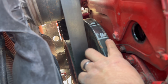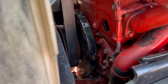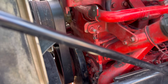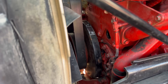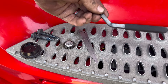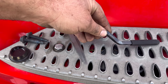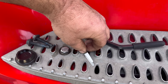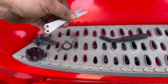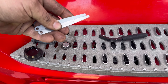Your balancer will have these marks - kind of like lines drawn in dots. If you're smart, before you put that on, you draw yourself a nice line with a paint marker so you can easily see them. This is what we're using today - a seven millimeter gauge. On this engine it takes a seven. Exhaust is 27 thousandths feeler, and intake is 14 thousandths feeler. That's how you set the overhead on these engines.